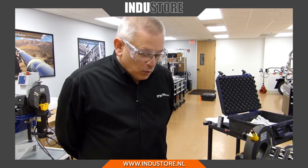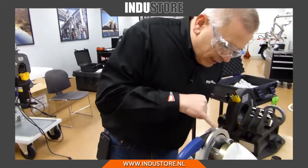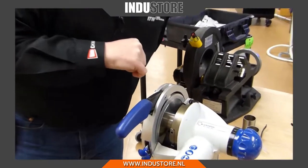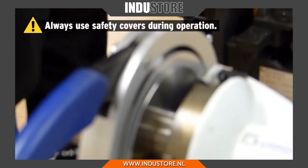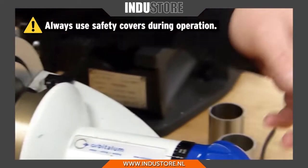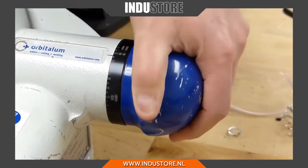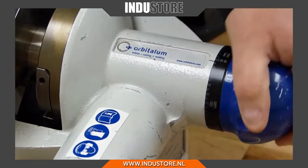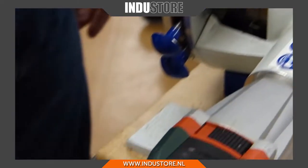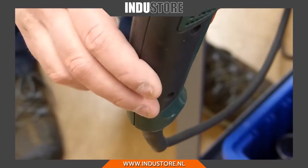With the RPG 4.5 and a piece of tube clamped in, we're going to show you exactly how this will do the facing operation. You can see through this window — we've removed the protective plexiglass purely for our video presentation so you can see exactly how it machines. The machine has a feed knob located on the back, that's what's going to feed us in and out, and then we have our drill which will power the machine and give us rotational force.